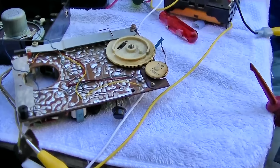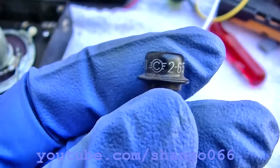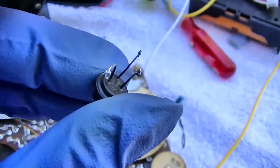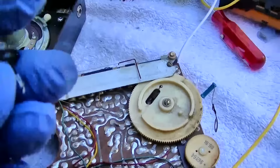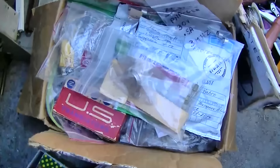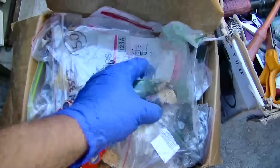Two of the leads from the transistor I suspect is bad are extracted. Starting with 3.3 volts — hardly any draw. Going to 6.6 volts — wow, a shorted Russian germanium transistor. Let me get it out. This is an MP-40, made in February of '65. I like to keep things like this all original. I realize sometimes it's not possible, and I do have MP-40s, but they're going to be white. This box is my germanium transistor collection.